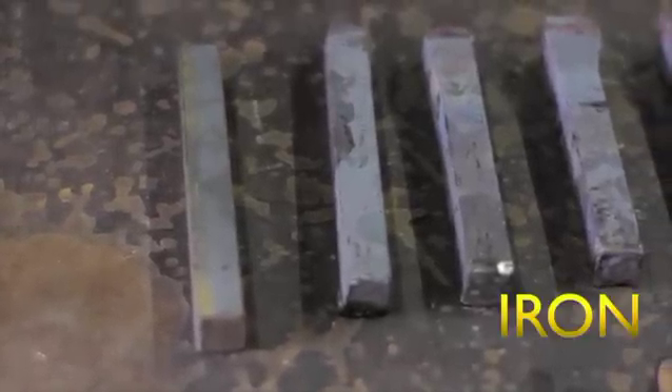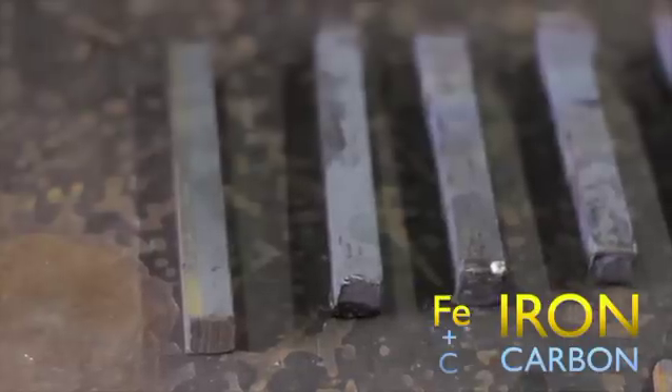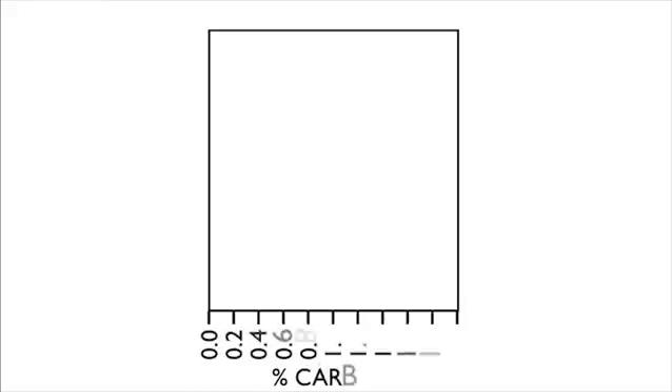So what exactly is happening to this block of steel as it is being heated to such extreme temperatures? Steel is an alloy consisting primarily of the elements iron and a small ratio of carbon. As you let the steel heat up, carbon begins precipitating away from it. Generally, steel has about 2% or less carbon content. Although minute, carbon has a great impact on the crystal structure.